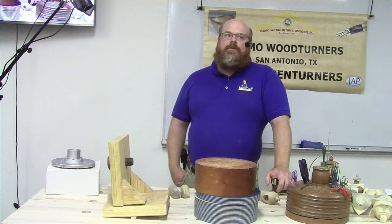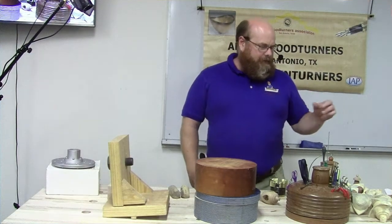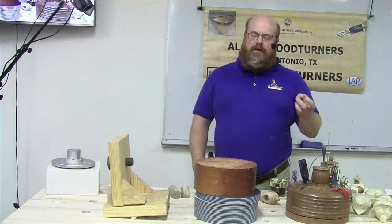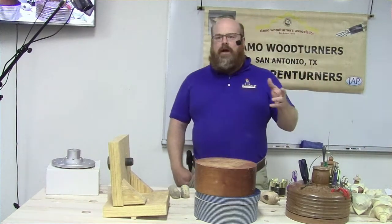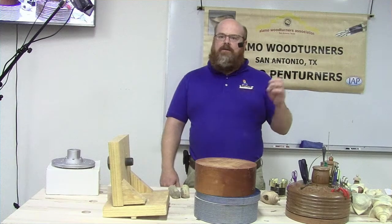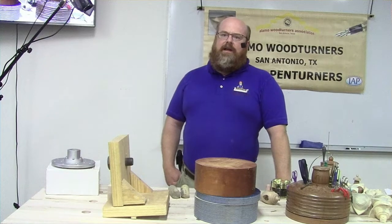Most of the time, I use a very limited selection of tools, just because it's the way I've taught myself to turn. I use a 1 inch and a half inch skew. I use a 3/4 or a 3/8 spindle gouge, and I have a 3/8 bowl gouge from Crown that I use when I make these. The skews, I run a 600 grit credit card hone before I start each one, takes 10 strikes on both sides, and then that's it. The spindle gouges I'll sharpen every morning. Usually they'll make me the day. It's cryo steel, so it'll make me a day without having to worry about sharpening them.